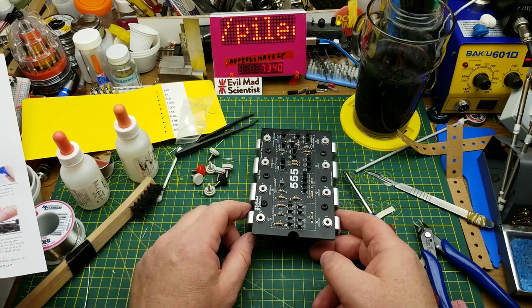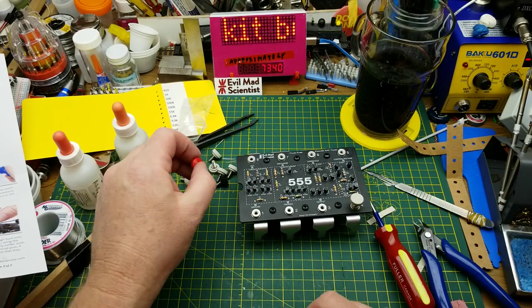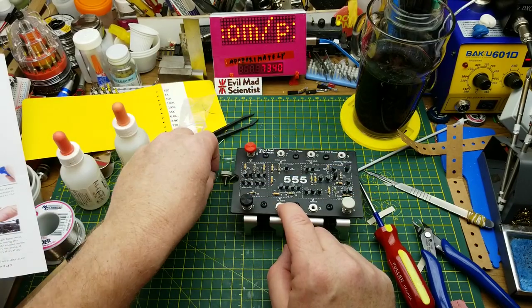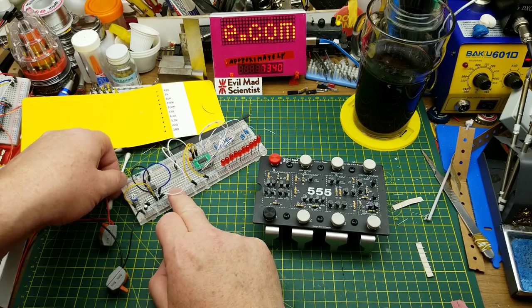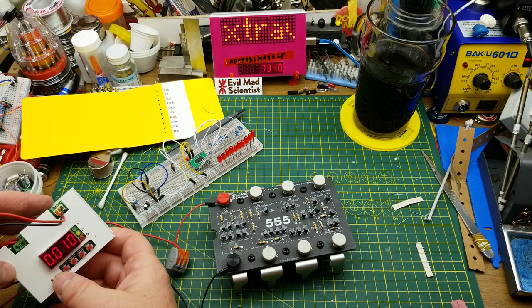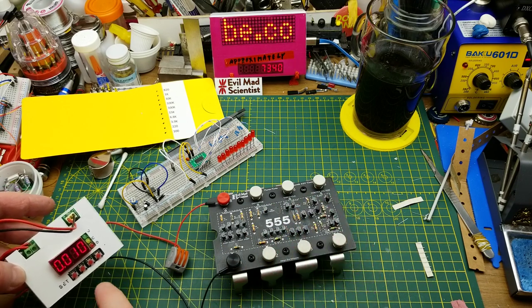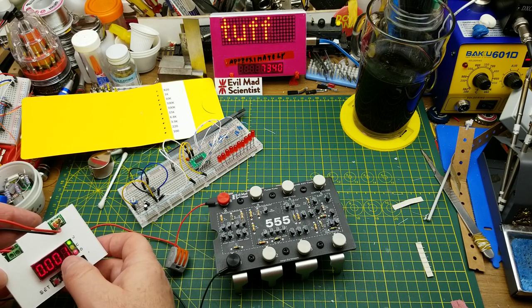There we have the stand and legs assembled. Now there's nothing left to do but put the electrical connections on: a red and a black one for VCC and ground following standard conventions, and then these gray ones for all the signal pins - you just thread them in like that. I'm going to test this by substituting it for the 555 in this circuit, but first just a basic smoke test: five volts and ground connected, with the power supply set to a 10 milliamp current limit so if something's wrong it won't give it enough current to blow anything up. It's not drawing any significant current - about 1 milliamp. That's good.